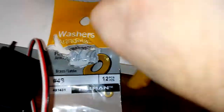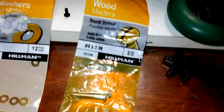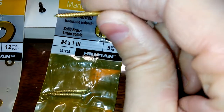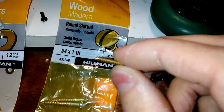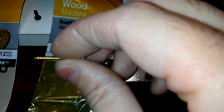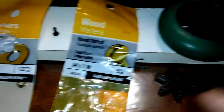Let's talk about screws. We measured them and they were 2.5 millimeters — spec says 2.6 — and nobody makes that screw. What I was able to do is at Lowe's, and I'm sure Home Depot has it too, I could get these one-inch number four wood screws. They're actually a little too big — they'll screw a little bit into the servo horn but not all the way. What I've been doing is just chucking them in the lathe and shaving just a little bit off those threads.